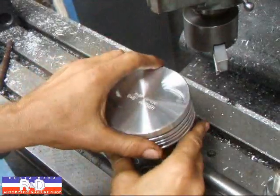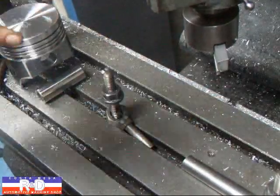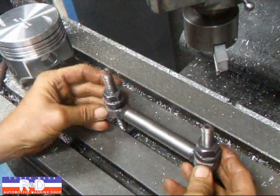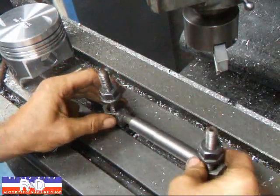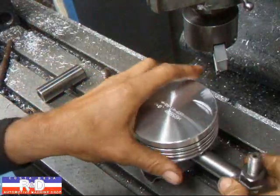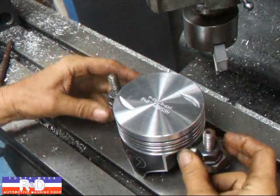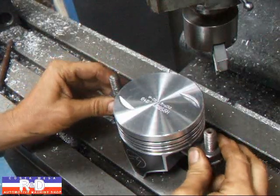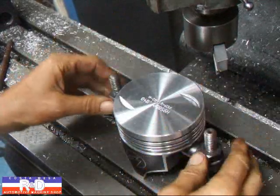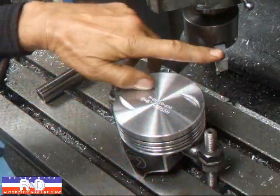You might be asking yourself how do we hold this piston to our table, because you can't hold on to it from the sides. I've made up a little fixture that I use for jobs like this — one side goes in, the other side goes in, and you bolt this down. Of course there's always the question: can't you tighten one side more than the other to bring this side down or the other side down? Yeah, that's true, and we have to actually align the piston to our cutter.